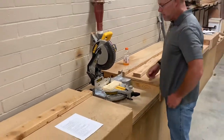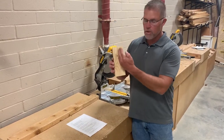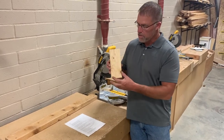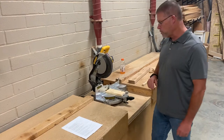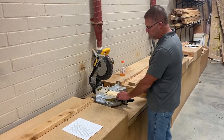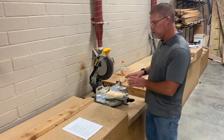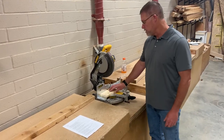I'm going to cut some wood here in just a second. Another thing: this saw is only for cross cutting. So if you look at this piece of wood, the grain goes up and down — that's with the grain. Across the grain is this way. So this saw is set up to go across the grain, cross cut, or a miter cut, but we don't ever want to rip with this saw. That operation would not be correct — two reasons why. Number one, your fingers are way too close. If this board was shorter, my finger would be directly in line with the blade. The other reason is because the base is too narrow. Some people get impatient, like they're waiting for the table saw and it's taking too long, so they'll try to rip on the miter saw. Really bad idea. Just need to wait patiently for the table saw to open up if you're going to rip something.